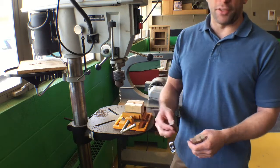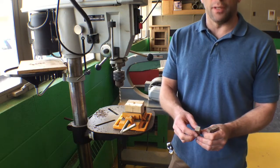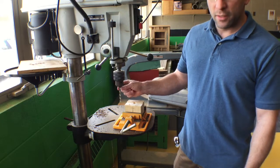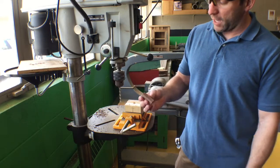I've done enough of these drillings, I'm just going to line the bit up to the center and drill through it. The key is to not force the bit — you have to chuck the bit up all the way into the chuck so that it doesn't have any wander, because it wants to wander through these blanks.